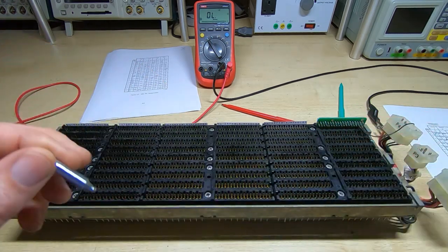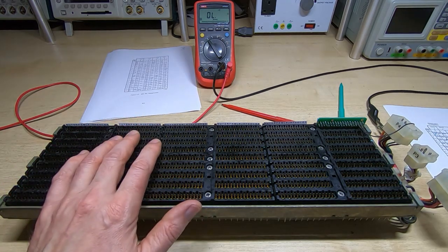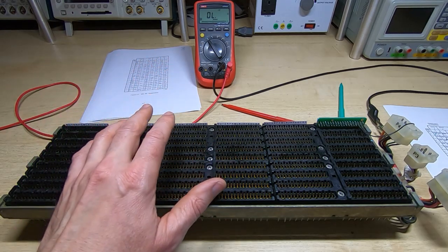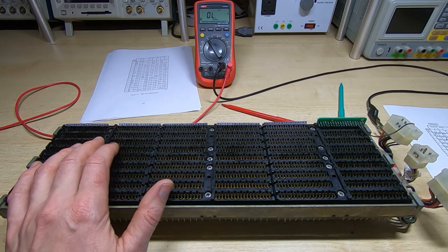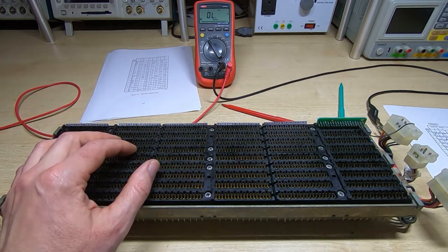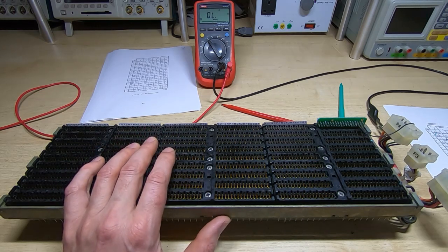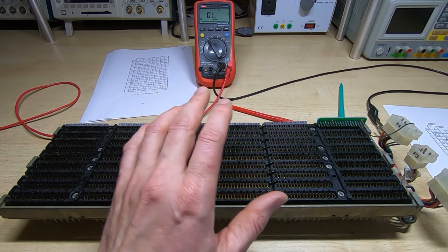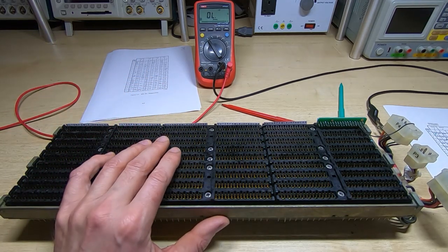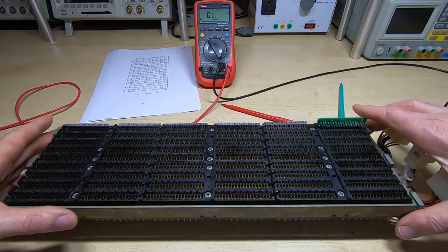Checking under a microscope, these are re-soldering reasonably well. I've been through it once and found about 142 bad or intermittent connections, re-soldered those, changed something like 22 wire wrap wires. I went through it again and found four connections still not right. I'm about to go through and try it again, but I'm getting closer to the point where I can at least reinsert the boards and see what other issues still exist. It takes about an hour and a half to test each time, so it's not particularly time-consuming once you've done it a few times — it is a bit tedious. But I do not think this is a long-term fix; more and more joints will start to fail.